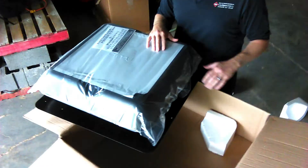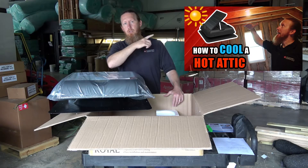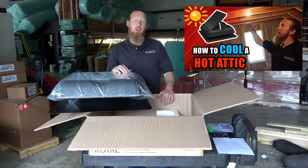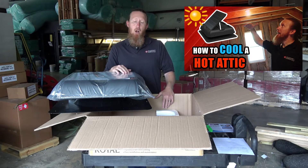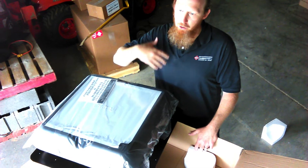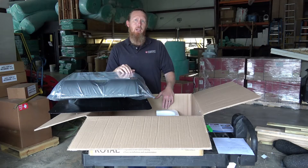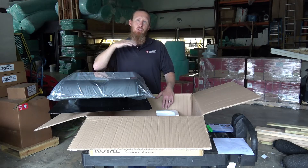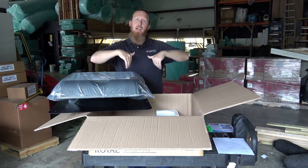We recently did a job here in Knoxville, and we got a video right here — here's a screenshot of it so you can take a look. We're also going to have a link down in our comments about this solar attic fan and the installation. She wrote us a five-star review about how quickly this fan, along with a little bit of insulation, helped cool off their second floor. If you are having a hot bonus room or a hot upstairs and your heating and air unit is having trouble keeping that area cool, installing an active solar attic fan is a great way to get that heat out of the attic and start the cooling process. Because the hotter the attic is, the more likely that heat is going to transfer down to the floor below.